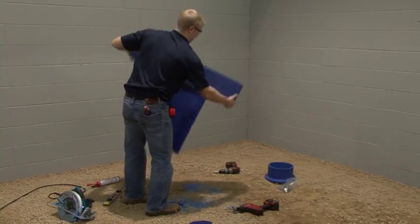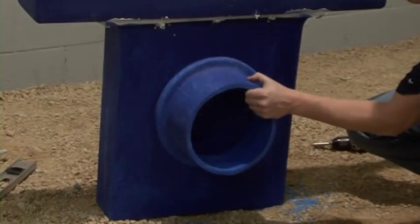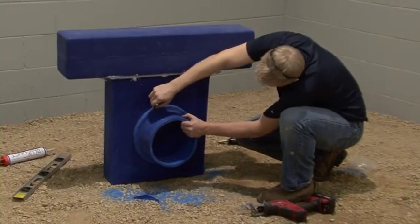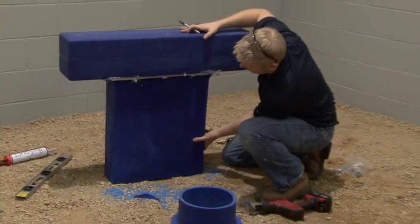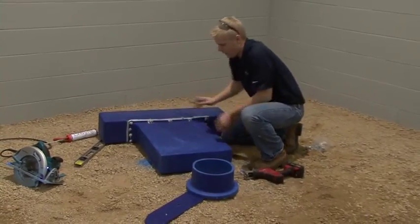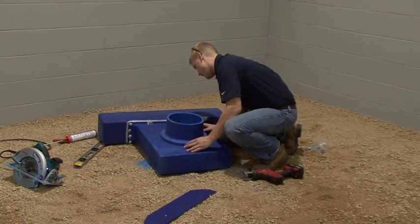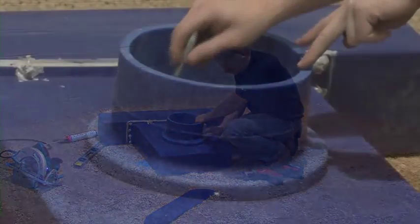Set the assembly in the trench and determine where the lateral run is going to meet the face of the linear diffuser adapter. Then mark the spot where the duct meets the plenum adapter box on the linear diffuser adapter — this is where you will attach the plenum adapter. Lay the linear diffuser adapter on the ground with the inside and outside dimension of the plenum adapter marked on its face.